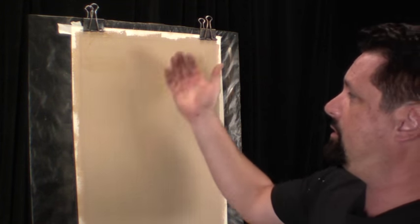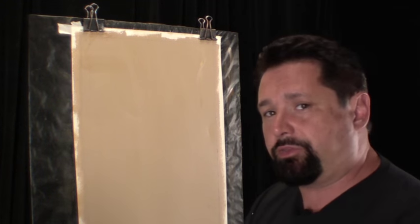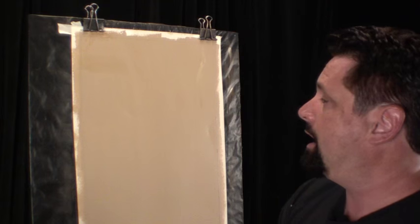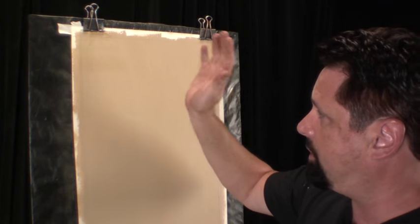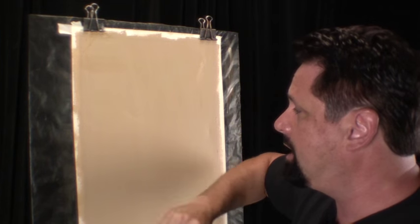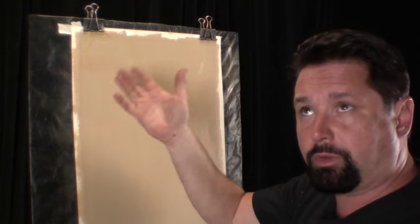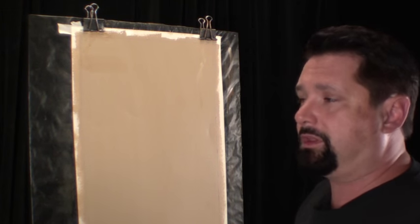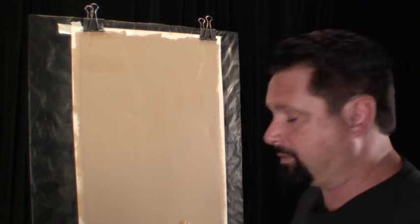The reason why is even though walls look smooth in brand new houses, they're far from it. When you get in there with a 9-inch roller and you find somebody sanded a spot too hard or built up a seam too high, you get a little depression with thicker portions of glaze in that area. We don't want that — just use a 7-inch roller.